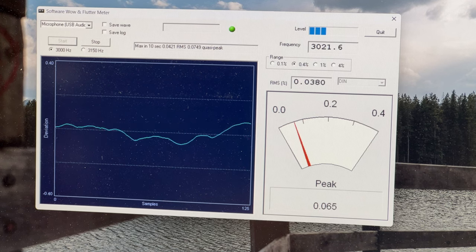And, oh yeah, I can show you that sliding interlock plate, I should say. It's just right up under here. It is spring-loaded. So, it takes some fiddling to get it to work properly, but you'll get it. Momentary confusion has passed. The two screws we actually want to get access to are this one down here, below this control, and this one up here.